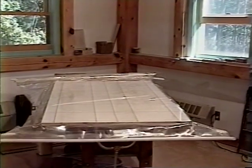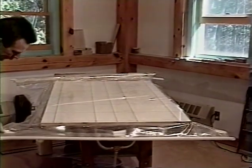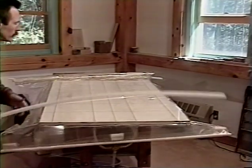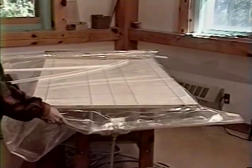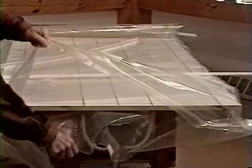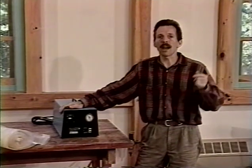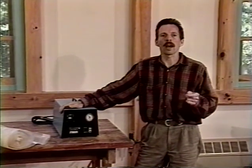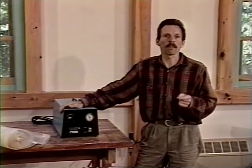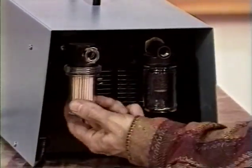What I do is simply leave the pump on, open up the bag, and remove my work. The pump will automatically come on, drawing in fresh air. I let it run for about 5 minutes. This not only purges the pump, but the extra time allows the friction of the vanes in the vacuum chamber to vaporize any residual moisture. I recommend this process even if you have a compressor-driven Venturi type. A pump put away clean, no matter what type, will continue to perform properly. Keep your filter jar clean.